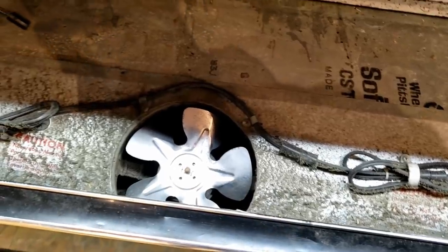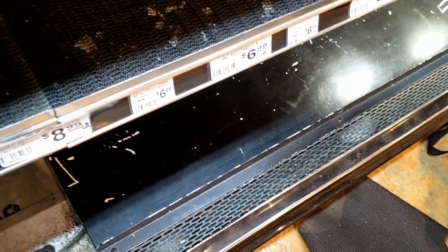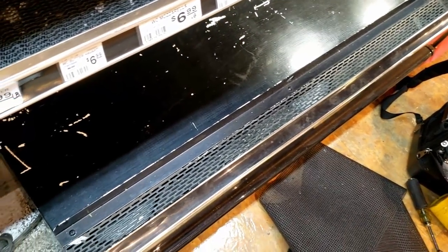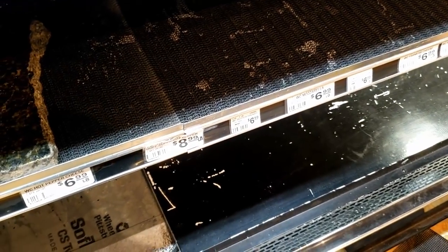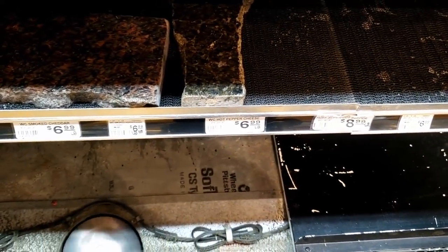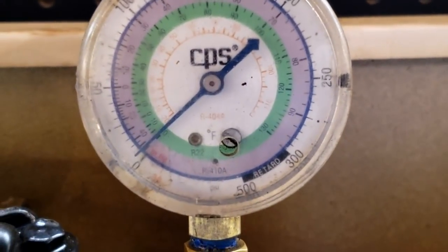I already cleaned off some of the other unit too — it's always a mess. You can actually see the fan blades through that hole now because it sucks air in through there and blows it down through the coil and then out the back through those holes. Good air flow is important. The unit is back in there, nice and clean. It's staying pumped down, which tells me the solenoid is holding. Five pounds is plenty as far as the pump-down part.